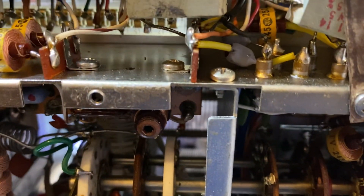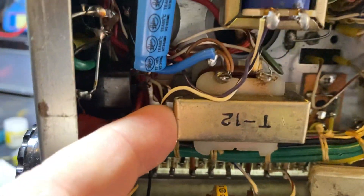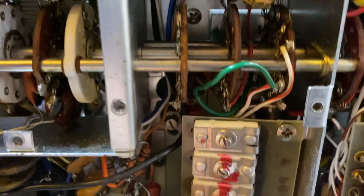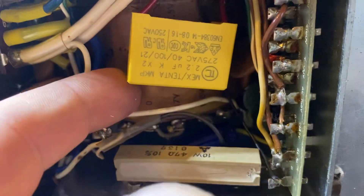Do not modify them, people — do not modify these units. I've got to check the speaker because I don't think it's working. If it's not, I've got plenty at eight ohms — nothing special. I need to take that transformer off to get to the two big caps and solder in new caps. Do not touch the alignment trimmers in there — a lot of alignments in there. I've seen a lot of them being touched. These are good caps — they last a long, long time.